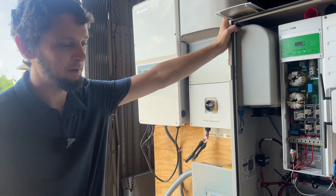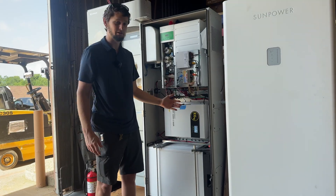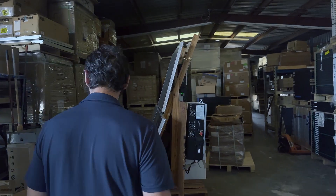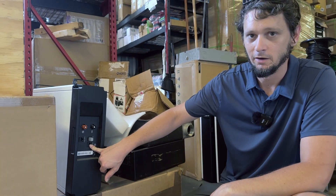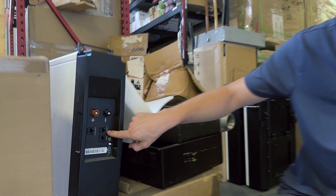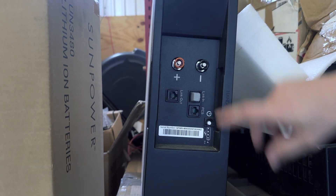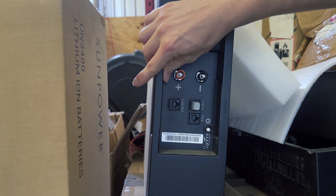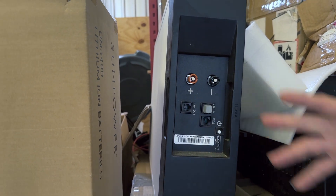After you've got the AC stuff figured out, the next thing is batteries. In this cabinet you can fit three batteries — battery one sits at the back, battery two, and battery three sits on top. There is an orange cord coming down from that SunPower Multi-IO, and that's going to go right into the PCS port of your first battery, battery number one. The other two ports are link-in and link-out. Link-in is going to get a terminator plug — you get one of these for every battery, and there will be one inside the packaging. Link-out gets a standard ethernet cord from link-out to link-in of the next battery. These are included with the vault, but if something is damaged or missing, it's just a standard ethernet cord.